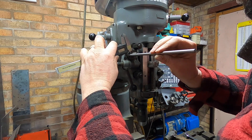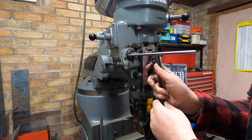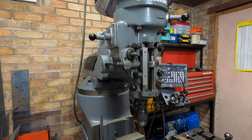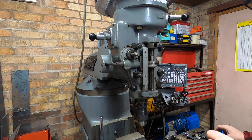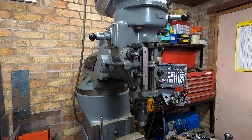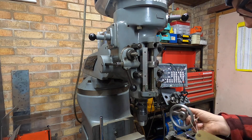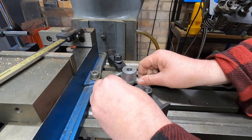It goes in alright. I'll call that 4.75mm between the pins — I hope you're all loving the fact I'm doing this in metric. We'll call that 12.64, and we'll call our pin 4.78. So if my calculations are correct, the centre of there to the centre of that hole is 13.46mm, which is close enough to being 17/32 of an inch. Right, to hold this down — I'm not going to tighten these up too tight, it doesn't need it, it's only aluminium. That's not going to move.